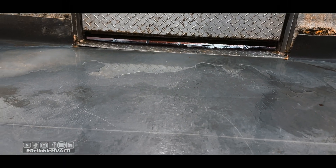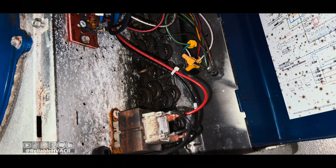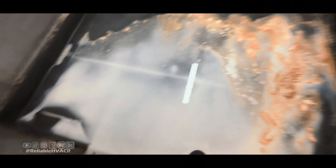I did mention to them during that install about the gap on the door — there's a gap at the bottom. This system was put in recently and it's already full of mold. Right outside are the fryers, so when they clean they throw water, cleaner, scrub, and hose it down. They do try to squeegee the walk-in box out, but that huge gap means you're getting a ton of water in there — that's where the mold is coming from. We're going to see if we can get them to let us seal the door.